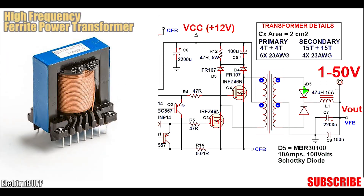For the transformer, it's a high-frequency ferrite core power transformer — the small black transformers available in many switch mode power supplies. You can salvage one from an ATX computer power supply or purchase one. The core area should be at least 2cm² to handle at least 300W without a problem. The primary winding is made up of 4 turns on each half using enameled copper wire of gauge 23 AWG with 6 strands in parallel. This eliminates skin effect at 45kHz and allows it to safely handle 25A, since one strand of gauge 23 handles about 5.5A.